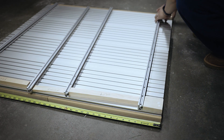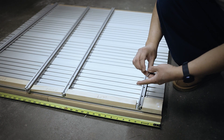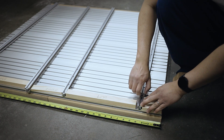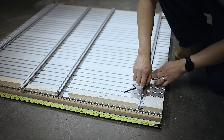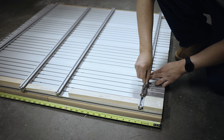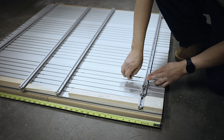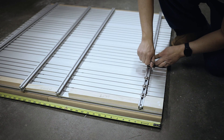The Misumi flat aluminum extrusion consists of a staggered top and bottom, an M5 T-slot on one side, and an M6 T-slot on the other side. Since the linear rail is M5 T-slot, I'm going to be using the M5 side for the flat aluminum extrusion. To bolt this together, I'm using an M5 screw with a 30mm length. For clearance, I need to double up a nut and washer so I can bottom out the screws without hitting the aluminum extrusions.